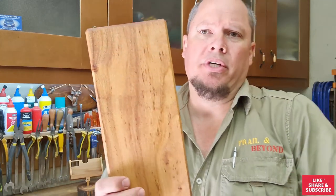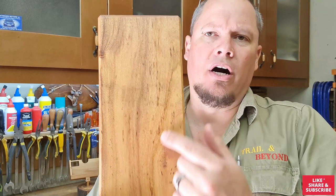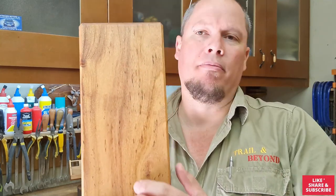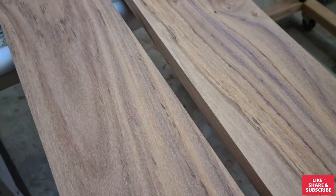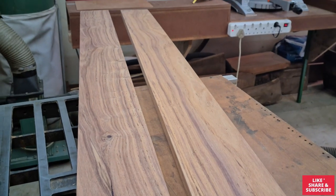Here's a sample of the wood — you can see it's quite appealing, with a yellowish appearance with dark streaks that can become dark brown or black. The wood is also really stable, not known for warping a lot when it gets wet or moist. As I'm building a cooler box, it will get wet from time to time. Even though I will put a Danish oil finish on it — which is not ideal for surfaces exposed to moisture a lot — I like Danish oil and I think three or four proper coats is sufficient as a sealant for the wood.